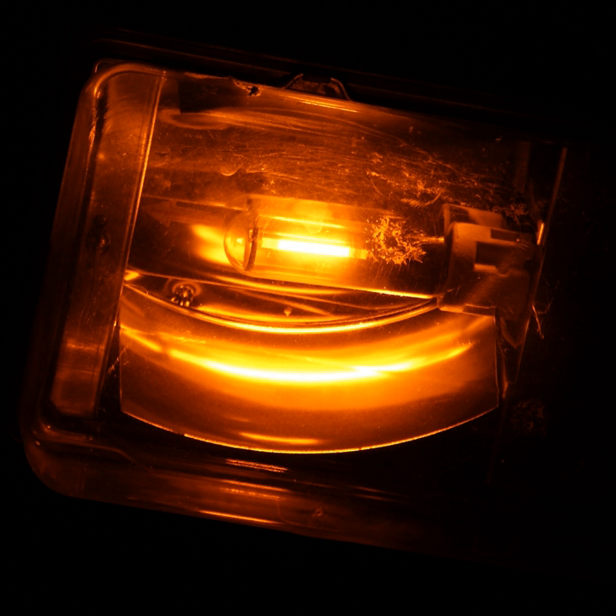High-pressure sodium lamps have been widely used in industrial lighting, especially in large manufacturing facilities, and are commonly used as plant grow lights. They contain mercury. They have also been widely used for outdoor area lighting such as on roadways, parking lots, and security areas. Understanding the change in human color vision sensitivity from photopic to mesopic and scotopic is essential for proper planning when designing lighting for roadways. High-pressure sodium lamps are quite efficient, about 100 lumens per watt when measured for photopic lighting conditions. Some higher power lamps, e.g. 600 watt, have efficacies of about 150 lumens per watt.